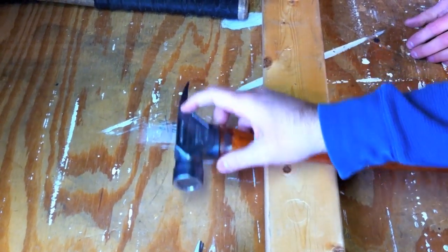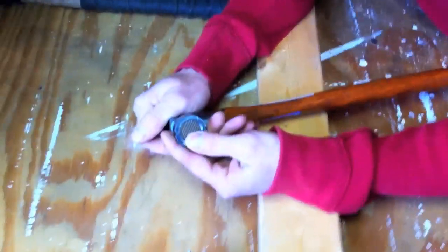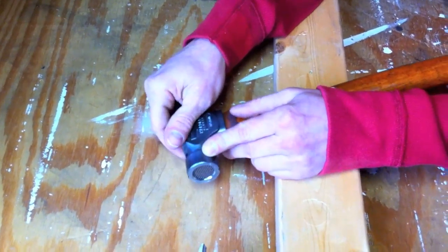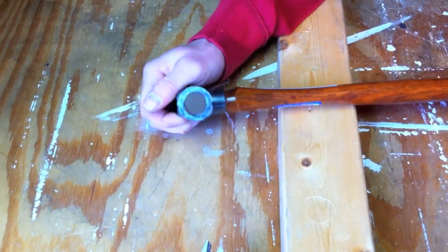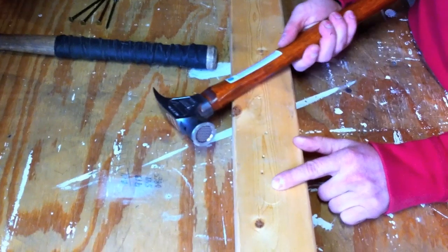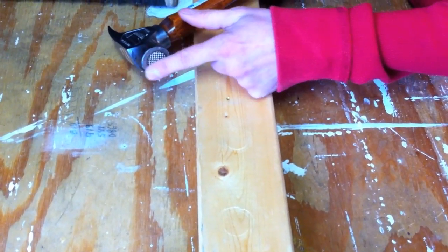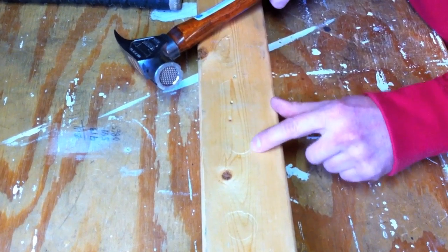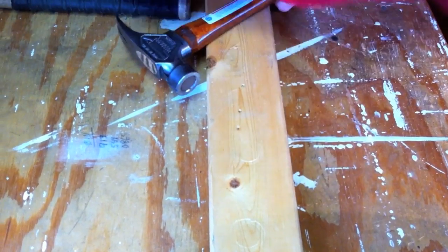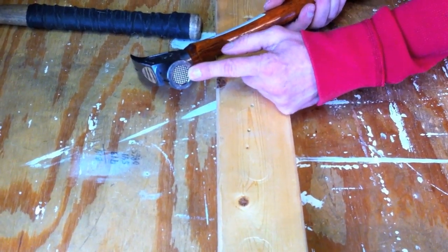Can you tell us a little bit about the head of the hammer? Well, what I did was take a hard steel core and recess it into the face of the hammer. So when you hit with the hammer, the force is absorbed into this smooth outer rim here. Your teeth never come in contact with anything but the nail when you're driving it — so your teeth are protected by being recessed.